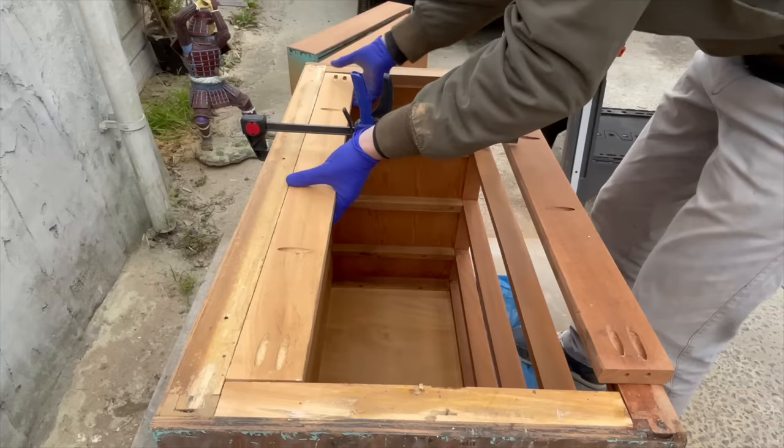I used a steel wire brush to clean up the mounting plates and a brass wire brush to clean the brass portion of the legs. And then I put them in my drill and I used some sandpaper to remove the paint from the wooden portion of the legs.